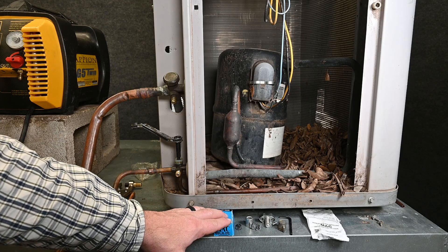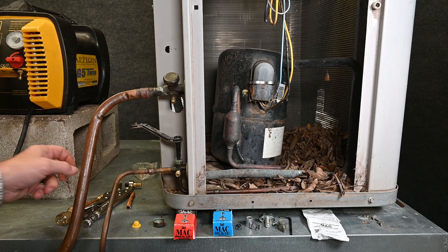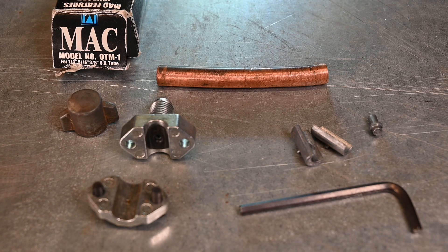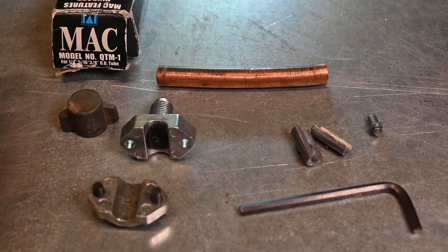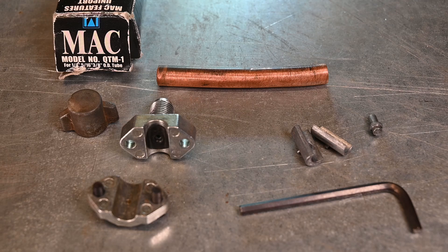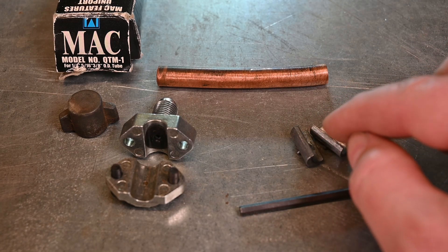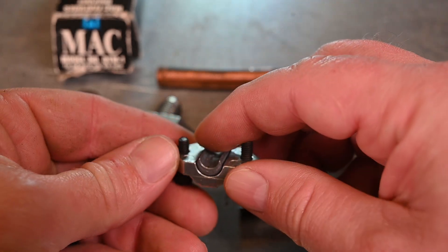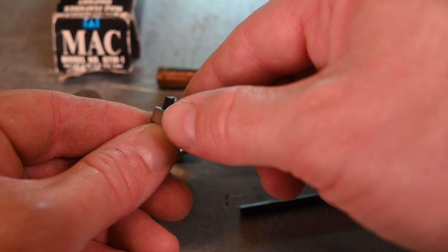Now let's talk about these line taps. These are old school ways, but if you had a Type 1 appliance, or if you had a pump down like this and didn't have any of the other methods, this is what we used to do. Type 1 appliances don't have any service ports at all. So back in the day we had these things called line taps - they worked with Type 1 appliances, or if we had to do a pump down and recover from the backside. We had multiple different sizes, and the box said what sizes. For example, this red box had half-inch and five-eighths. The copper we have here is three-eighths, so we're going to use the box that says one-quarter, five-sixteenths, and three-eighths, so it works for several different sizes. But we're using three-eighths, so we don't need the adapter at all.